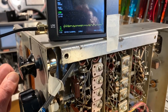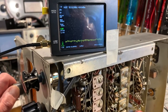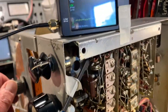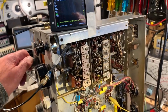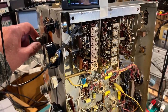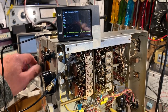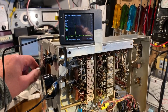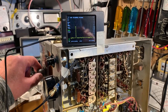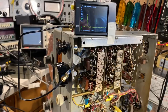But it's there. And it goes up to 52.5-ish megahertz, so that would tune about 53 megahertz, and the scale goes up to 54, so it's a little bit out, but there's nothing up there anyway. There's no stations to receive. It's all a bit of an academic exercise just to find out what it needed to get this set working on the band correctly. It's working fine on all the other bands. It's just band A wasn't working right at the upper end. There you go, NC-57 band A sorted out.